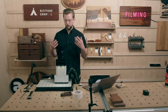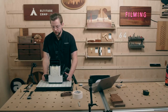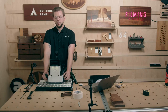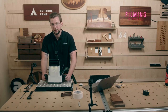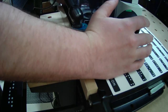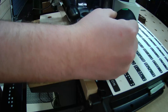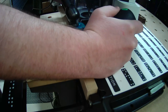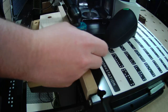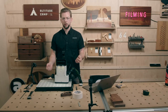Body language tip. When I'm doing motions like that, especially tight motions, and I'm cutting a dense material, instead of having my hands floating and rigidly attached to my body, I'm actually planting the sides of my hands on the workstation. So that side of the hand is planted, and I'm driving a lot with my fingers. Not delicate like this, so I still have a nice firm grip on the handle, but the side of my hand really anchors me down and allows me greater control. When I'm doing larger sweeping cuts, that's when I'm more connected to origin and I'm taking it along with me.